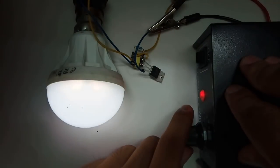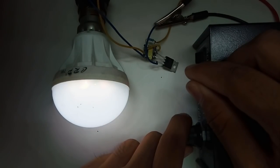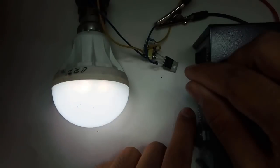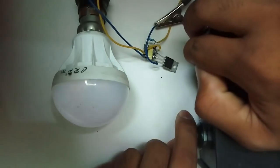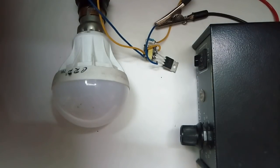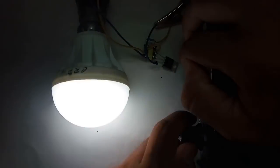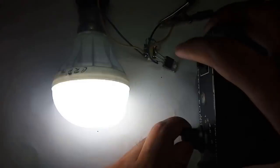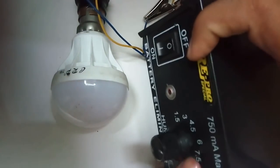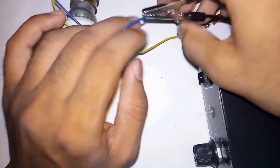This is the minimum voltage from the battery that we need. It seems there is a problem with this battery eliminator — the LED is not continuously illuminating. So this won't work with this minimum current; you need to use a higher current like 1A or 2A. So even this one won't work here. Let us see the next one.